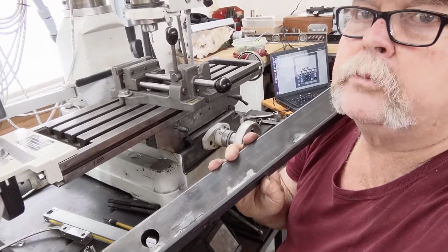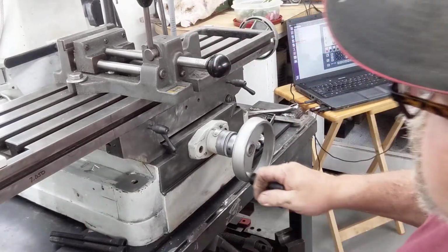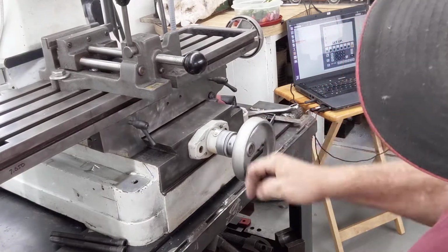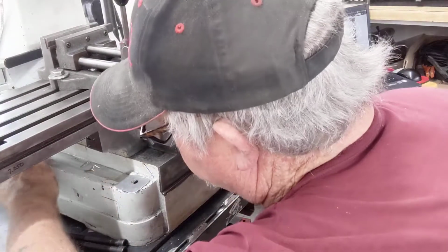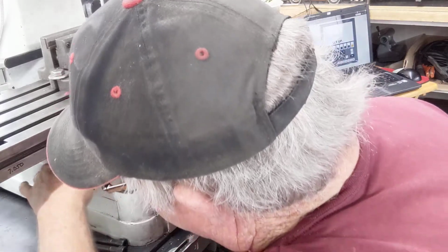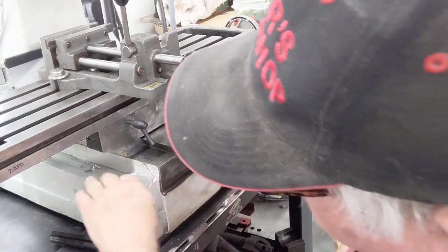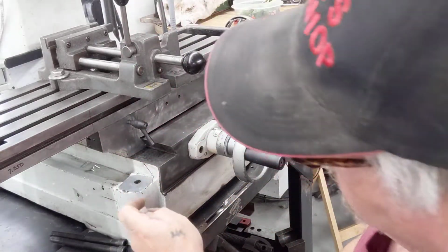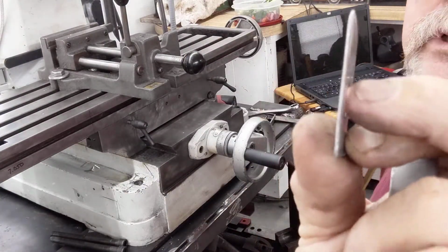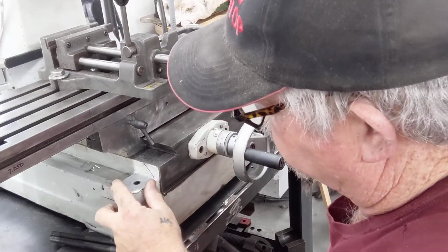But let's see if we can get you down in here and lay this out. Let's see if we can zoom this in a lot closer. The original bolt holes. Let's get this thing cranked out of the way here so you can see. And of course, as you know, these beds being cast, they come in here with body filler. I could have taken time to get this perfect, or hand do it with a longboard. But in lieu, I took all my measurements, got a shim here, aluminum, which is about 24 thousandths because it has a hump in the middle back down there.